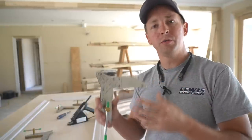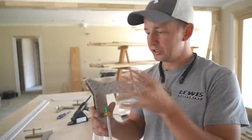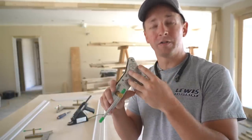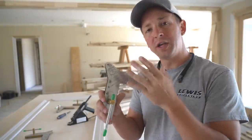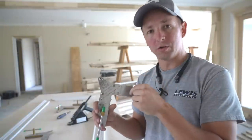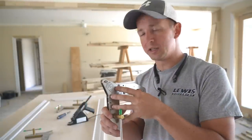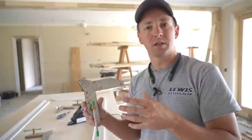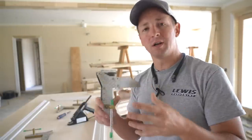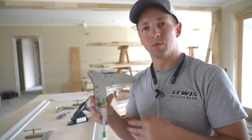With the hyper, you do want to use a cam action miter clamp. These here are clam clamps invented by Jim Chestnut, purchased directly from him — and I'm not even sure if he is actively selling these anymore. You do have to call directly to place your order. If you can't get clam clamps — say you live in Canada where he only ships inside the United States — go for a Miter Max clamp. Woodcraft sells them, Amazon sells them. They're manufactured in China and sold under a couple different brand names, but you can find them online and they also work well.